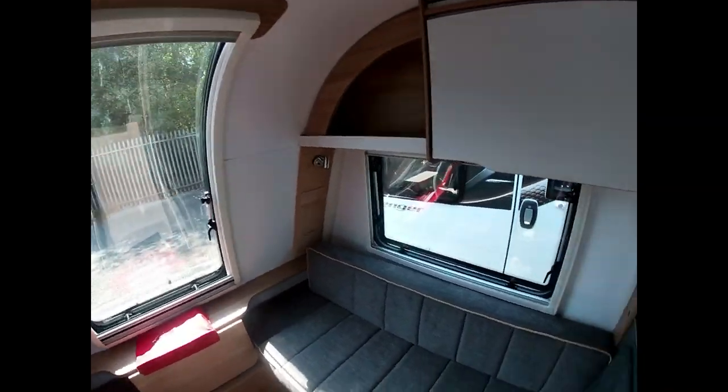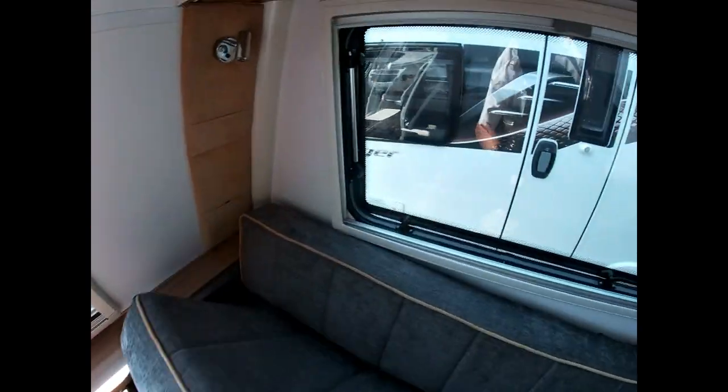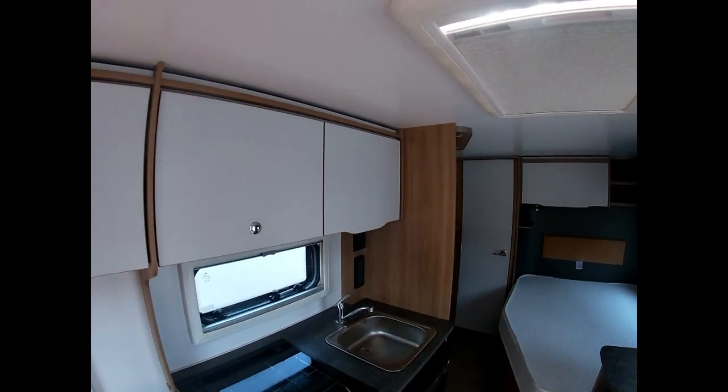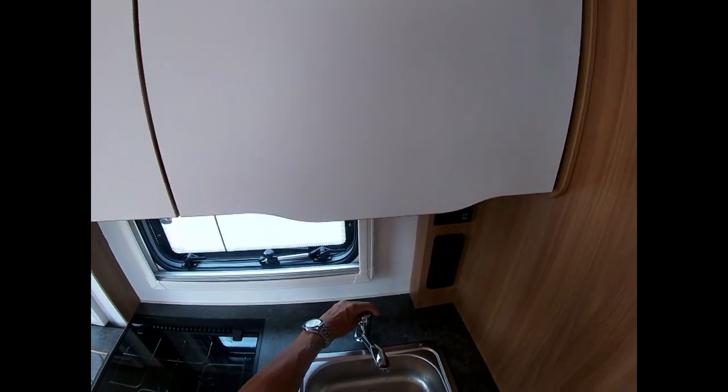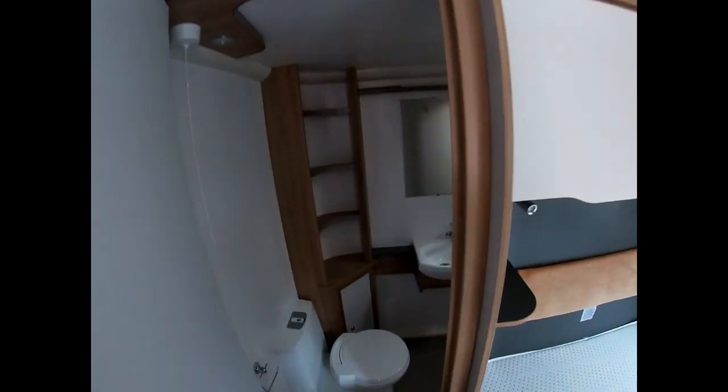because the first thing you really need to do is drain your boiler down, which is the yellow lever just underneath here. Okay, we can get our hand down between the bed slat, lift that up into the vertical upright position, and there we have it. That's now emptying my boiler to ground. So now when I set my taps to the mid position, I'm not going to get anything trickling out through the hot because it's draining down to ground. So we set those one and two and three in the mid position.